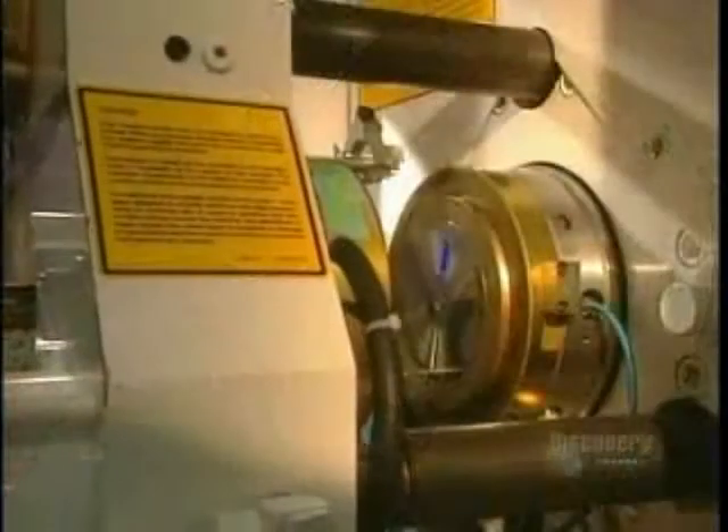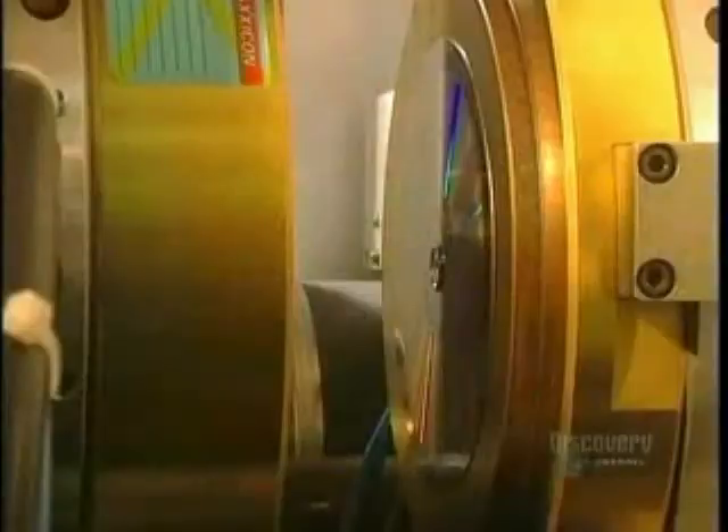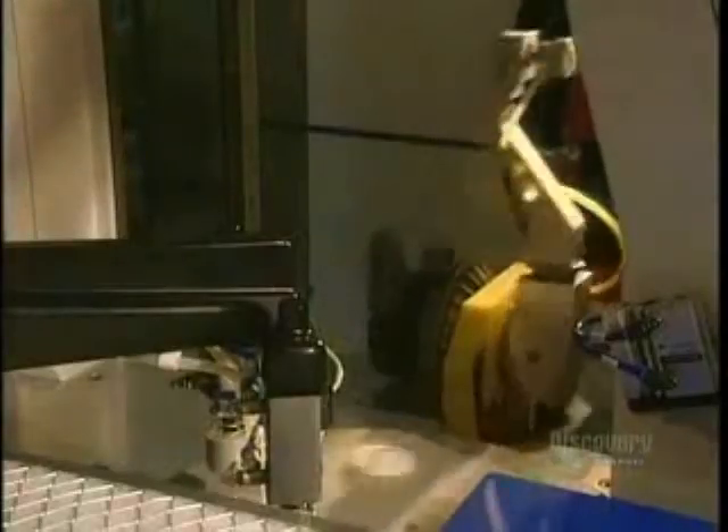Discs are made from a very special plastic called polycarbonate. The mold is closed and liquid polycarbonate is injected into the die. It comes out as a small, hard, translucent disc. It is now ready to be metal-coated so that it can be read by a compact disc reader.